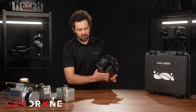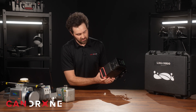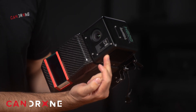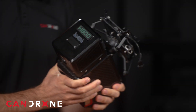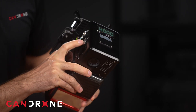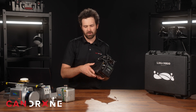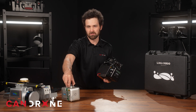Taking a look at this, the layout is somewhat similar to the X3H. You have the LiDAR sensor itself, and in addition to that, a 26 megapixel camera for point cloud coloration and for photogrammetry if one uses photogrammetry in conjunction with their LiDAR point cloud. You can see the ports for the GNSS antennas, an independent power supply, and of course the on/off button. Right away I can feel this unit is coming in at over two kilograms — about 2.25 kilograms — compared with about 1.2 kilograms for the X3 series.